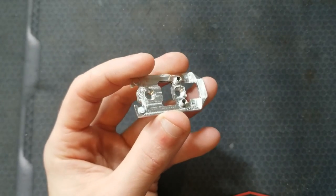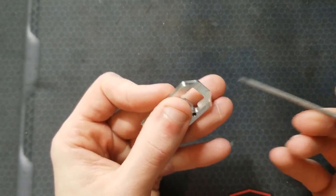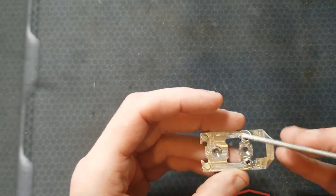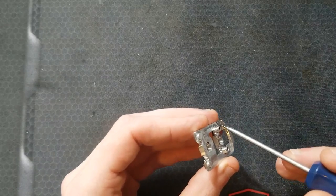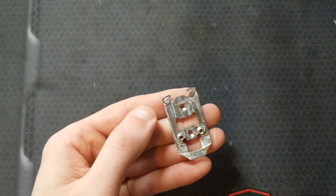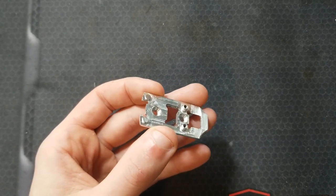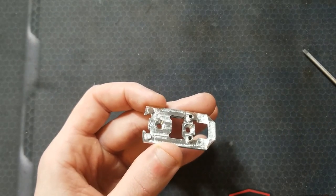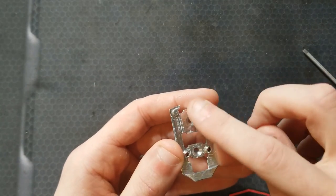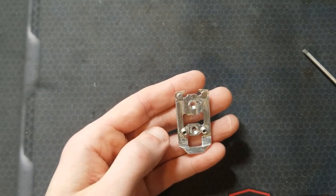When this plate came in, there were some burrs on it — on the backside here — but everything was super easy to take off with either a small file or a twist of a burr tool. I reached out to him because my optic wasn't sitting on there. It's because this part right here was a little bit too close to the back of the optic, and one of the posts was too high. I measured my optic and sent him the measurements, and it appears the specs for the recoil lug pockets on the Holosun 407 and 507K may have changed. I'm definitely not going to put that on him — it was quick and easy to file one of these down a fraction of a millimeter to get the optic to sit perfectly flat.